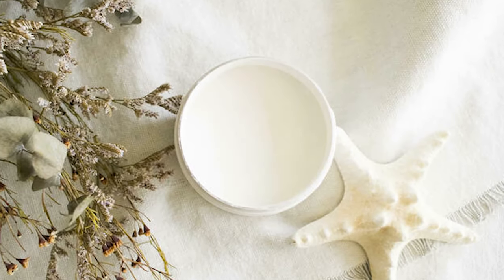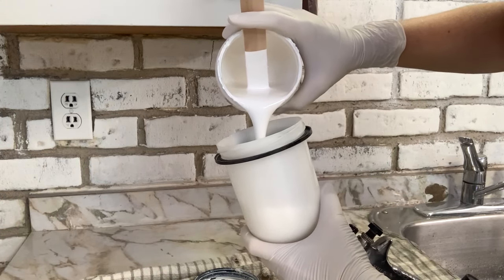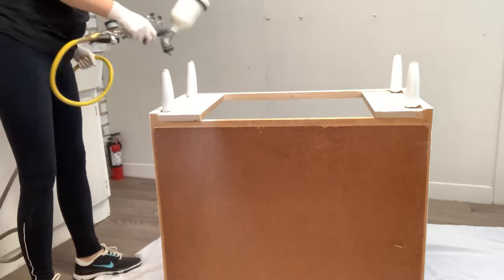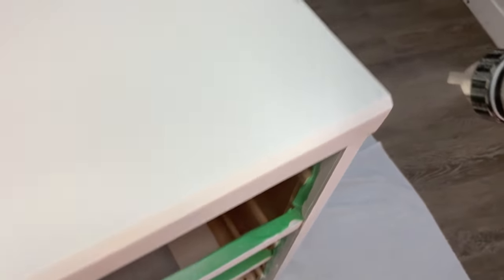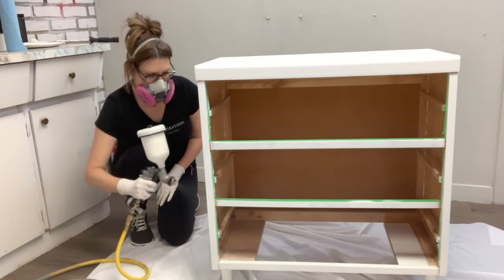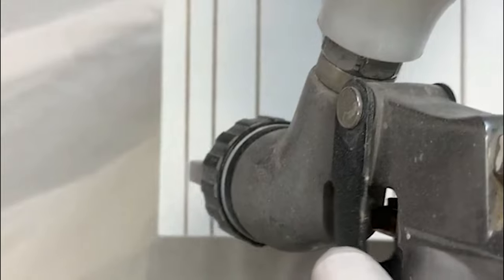For the paint color, I used Dixie Belle's Saltwater White. It's a perfect match to my Anthropologie inspiration piece, giving it a really nice, clean, crisp, modern look. The funny thing is, if I had known I was going to use this brand — which is a silk all-in-one mineral paint — I wouldn't have needed to prime, because this paint has a primer and top coat built right in. But I guess an extra few coats of primer never hurt anything. I chose a spray finish, but this is a self-leveling paint, so if you wanted to brush it on, you would also get a flawless finish. It goes on beautifully whether you're spraying or brushing.